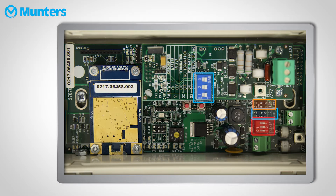Double-check and make sure your channels are the same throughout the farm. After that, check mode, power level, and communication protocol dip switches. All these are detailed in the R-Link1 video and manual. If only one or two houses are not communicating or have bad communication, this usually means that there is a line of sight problem or high voltage interference. Make sure that R-Link1s have a clear line of sight and they are not installed behind metal poles. Also make sure that there are no high voltage lines between the two points. Please refer to our R-Link1 video or manual for more elaborate installation tips.